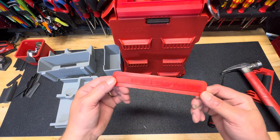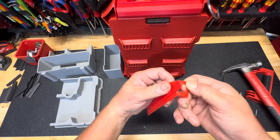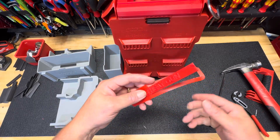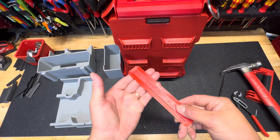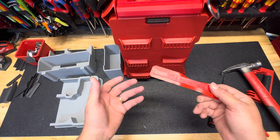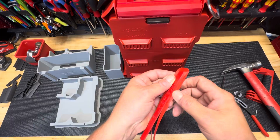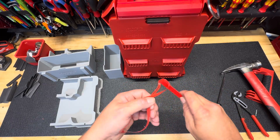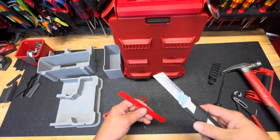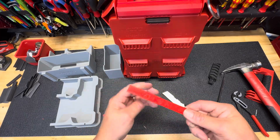Now I get my label. You might be wondering what this is around the outside — you could probably peel it off, and yes, you could peel it off. So what that is, that is called the skirt, or maybe the raft — it's basically like a stabilizer because this label piece is so skinny. It might not stick on the 3D printer and it might start moving around and then it's going to just print like crap. So a lot of times you add this skirt, which is just a small thin layer to give it more bed adhesion. I could peel that off, and on some areas there might be some sharp areas. I'll use my Tajima chisel knife here and I'll just clean it off a little bit, just to make sure it goes in there cleanly. You can always sand down the edge a little bit.